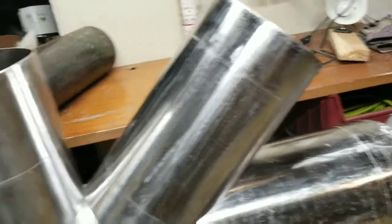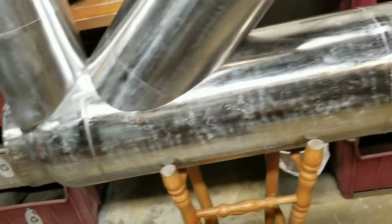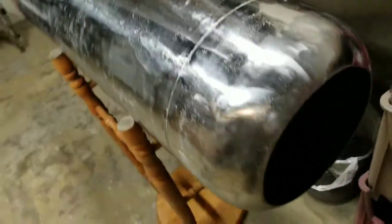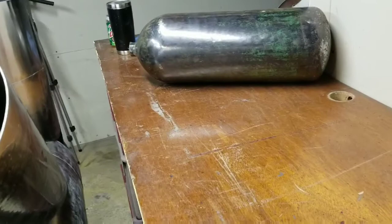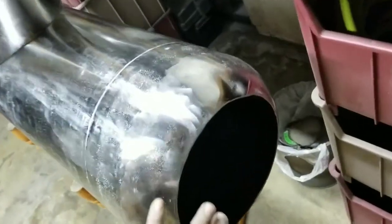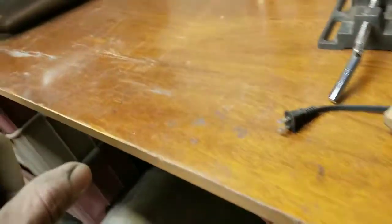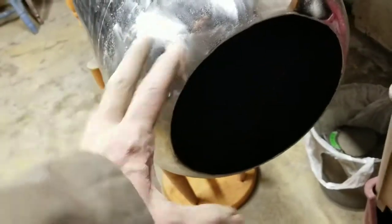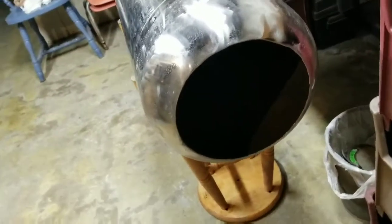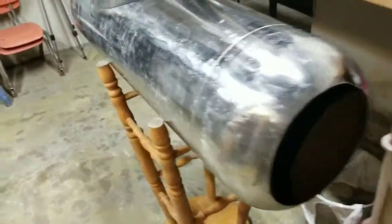Here's the feeder tube, there's the ash tube, and there's the stack. Here's the exhaust where I'll be putting in the boiler tank. That boiler tank will hang from in here — I'll have some bolts that will hold it. I'll weld some nuts onto that thing, put some holes in here and hang it through here. Then I'll have an additional aluminum stack to pull air and draft the fire.